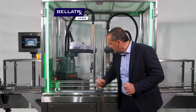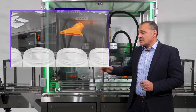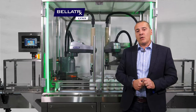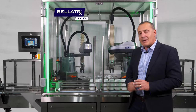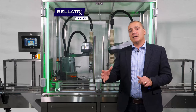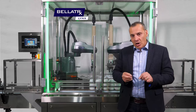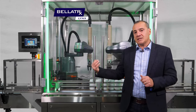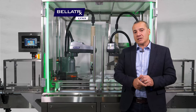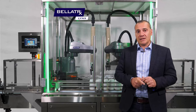The third question is related to the orange nozzles on the machine. You can see a couple of orange nozzles behind me — this is a dust extraction manifold. This is a powder application; we are inserting desiccants into a powder jar, and when inserting we get a small cloud of dust. These dust collection ports are required to control the dust amount in the working area.